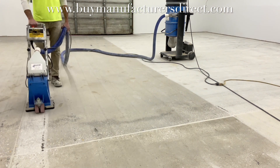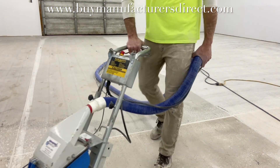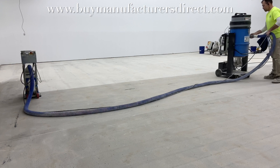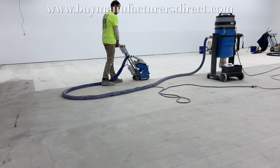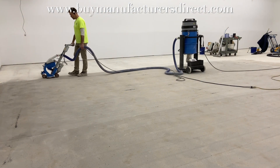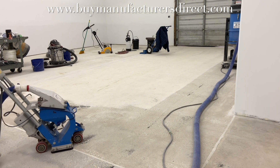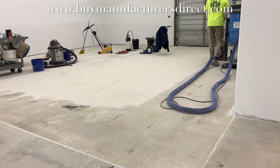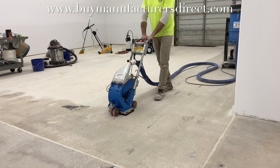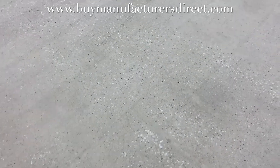As the process takes place, the surface of the concrete becomes physically more clean. The dust left behind is partly because vacuuming was only done half-heartedly, but also because mineral dust created during grinding gets packed into the pores of the concrete surface. Vacuuming alone — even numerous times — would still not get the floor as clean as the shot blaster, which agitates the surface under negative pressure like a sand blaster or power washer, but dustless and dry.